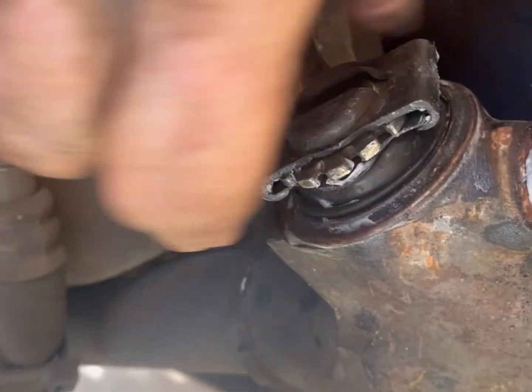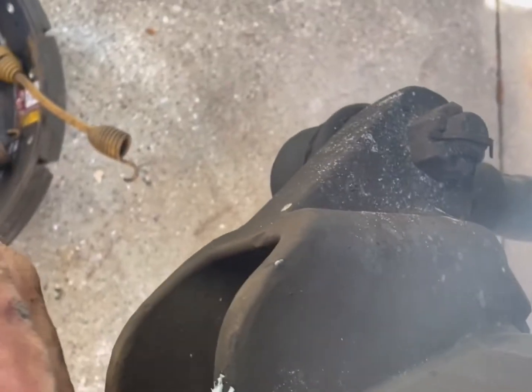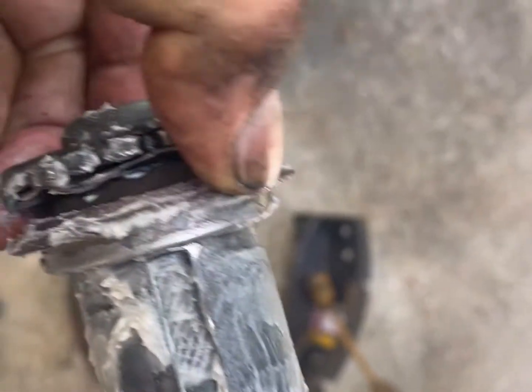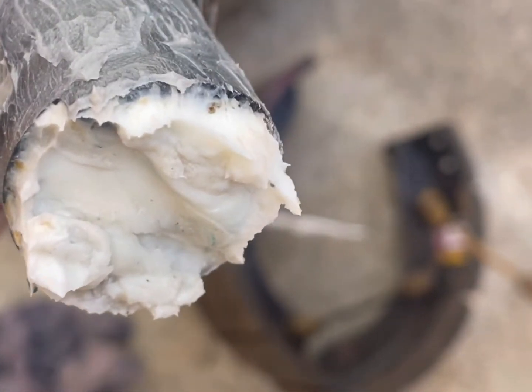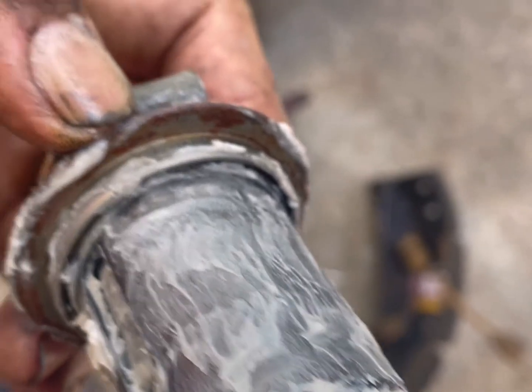If I go back with it and it stops, then I know I have that pawl locked in correctly, if I can still turn it. The other thing I wanted to point out is, in putting that chamber back in there, the slot in the outside piece goes towards where the pawl goes. That also coincides with, on the bottom, the wedge, the higher part of the cut goes towards the wheel, so that when the wedge comes out, it expands it.